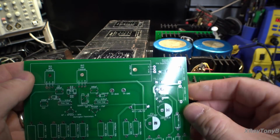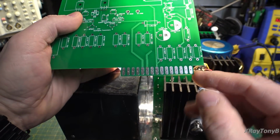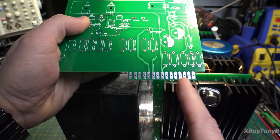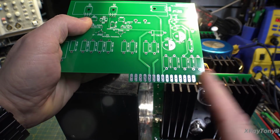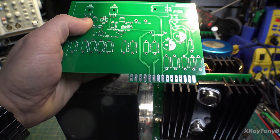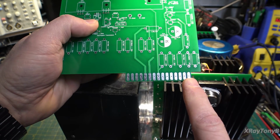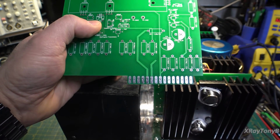The other thing that I noticed is when I designed this bottom part, there was no footprint for these connectors here at the bottom for this type of Amphenol edge connector. So I had to make this one using the footprint editor, and this is new.